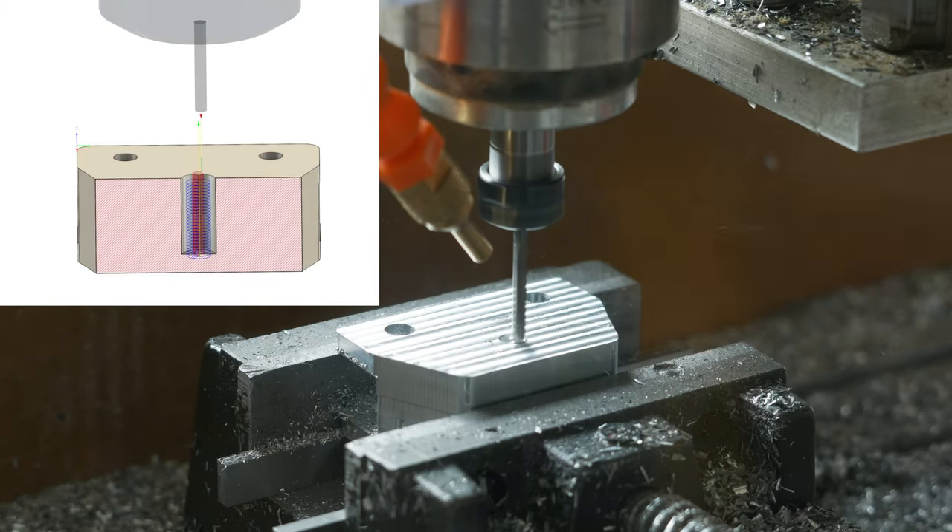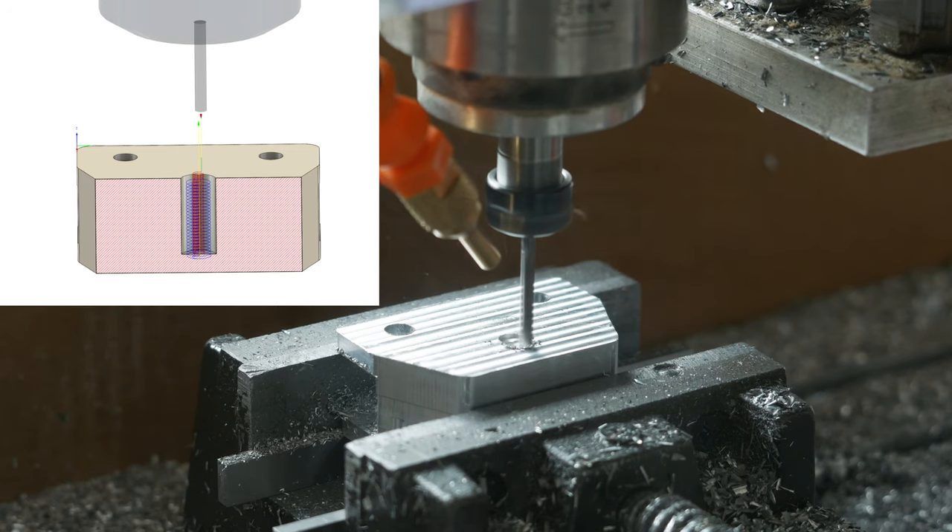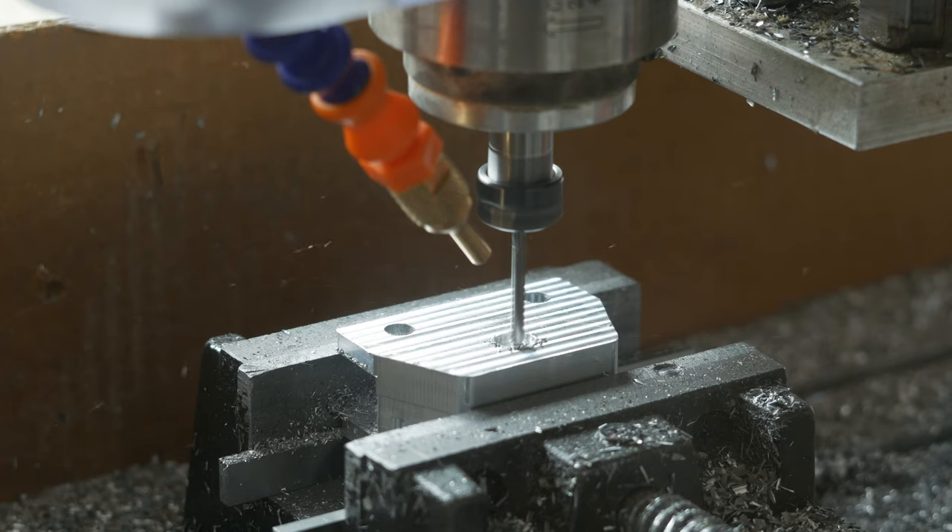A great example of how coolant helps: I was cutting a deep pocket, 25mm deep, with a 3mm diameter single flute end mill. Without coolant that would almost certainly have snapped the end mill. I flooded it with coolant and it completed the cut without snapping. Even at the end I could hear the chips grinding at the bottom, but the coolant really did help me finish that cut without breaking anything. If you want a nice finish, coolant is very beneficial. For most budget CNC users, mist coolant is the way to go — though you can also just use air alone to blow away chips and prevent recutting.